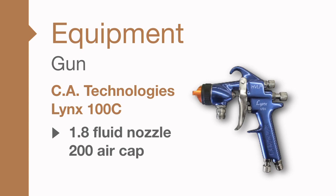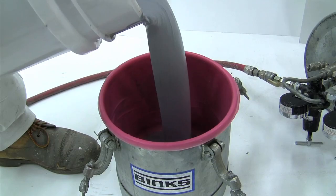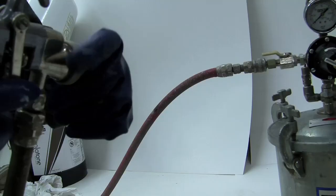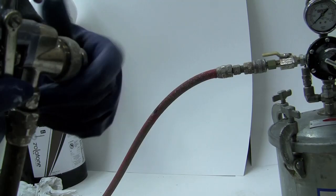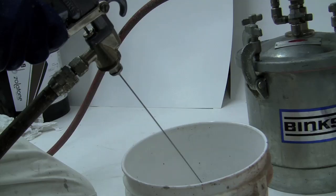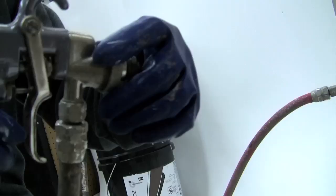Now that you have your gear, let's get started. Pour your mix-boxed paint into the tank and pressurize the tank. For beginning pressure settings, refer to the application instructions or paint can label. These instructions can also be downloaded from Zolotone.com. To prime the paint line, only the tank is pressurized. Remember to shut off the air to the gun before priming. Next, get the paint flowing. Remove the internal mix air cap from the gun. With the air cap off, check that the paint streams steady and straight. Reattach the air cap.